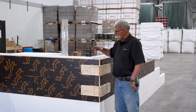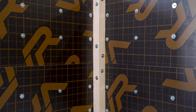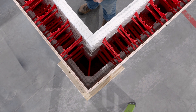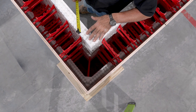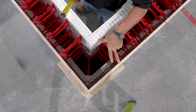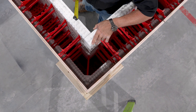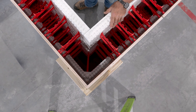Next, we're going to show you how to make an outside 90-degree corner and an inside 90-degree corner. The first question you need to ask yourself: do you want your red ties to line up the full height of the wall? It's going to take a little math and a measuring tape — cut this block properly to get these corners to work and end up with your 7-and-3-quarter-inch concrete core all the way around. You can see on this corner it's nice and rigid, with some additional support out there. That's what you need to have.